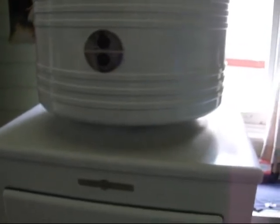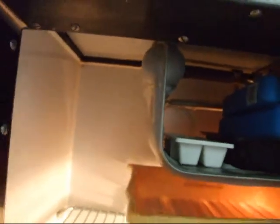So the float valve was damaged, the thing was open to the atmosphere. So as a result of that, I've had to do a capillary conversion, which I'll see if we can see in here. If I just move these out of the way. Okay, you can see a filter dryer, which is just a filter now, and the coil of capillary tubing. That replaces the now removed float valve.